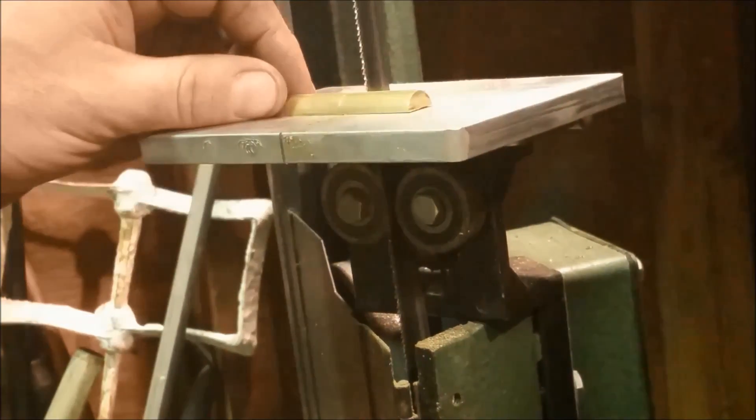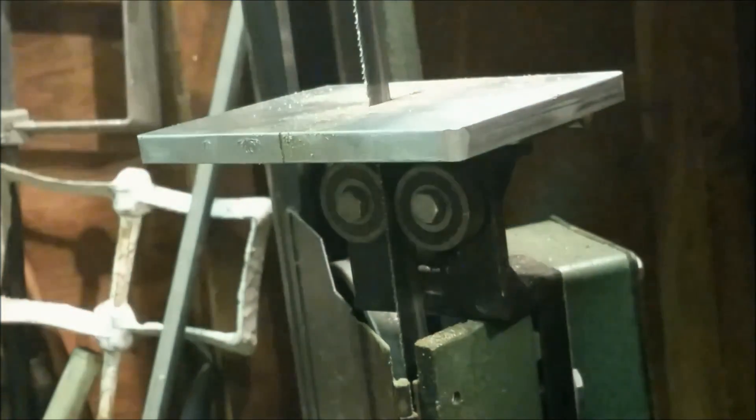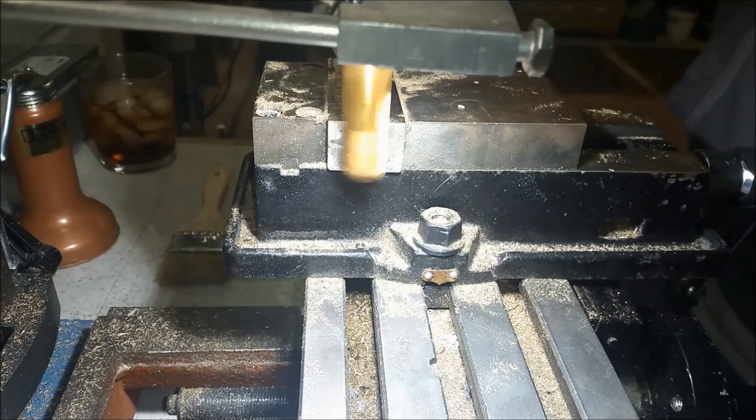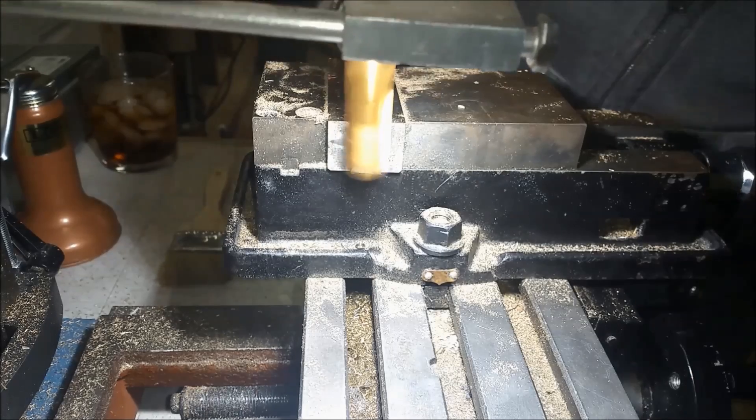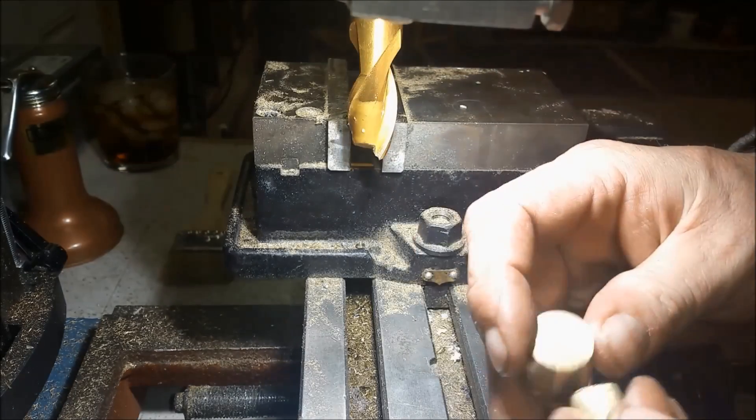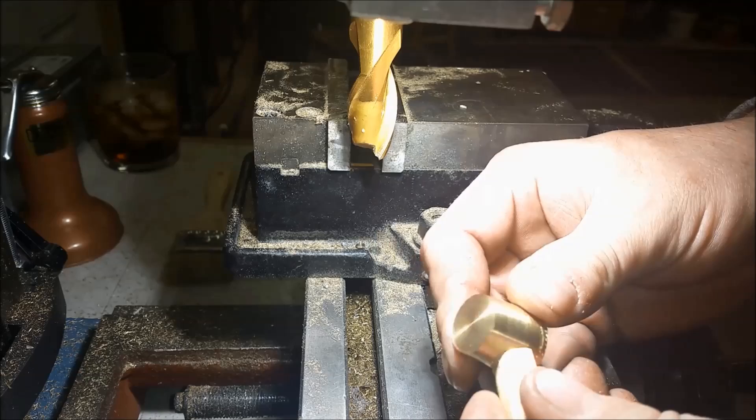With the cutting complete, now it's time to finish the inside of the spoke and I have to follow the pattern of the hub. I have these lifted up on the front to simulate a six-degree angle so when they fit together they fit together straight.